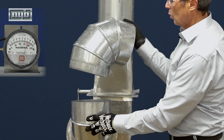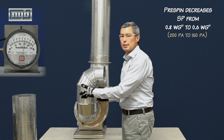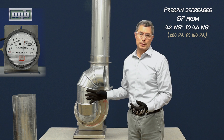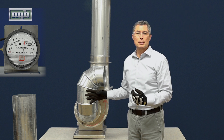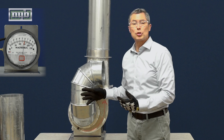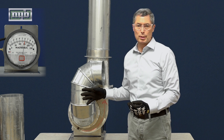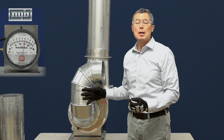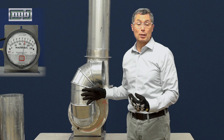We can rotate this 90 degrees, and now we are pre-spinning the air into the fan. You'll notice a couple things: flow pressure went down pretty substantially, and sound went down as well. That's because we're now rotating the air in the same direction as the wheel is rotating, and that results in decreased performance. That's similar to that same airplane taking off with a tailwind — the wing's ability to generate lift decreases pretty substantially. However, turbulent flow over that wing also decreases, resulting in lower sound levels.